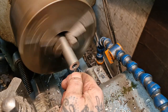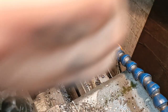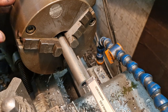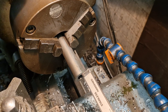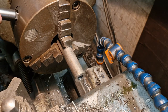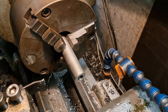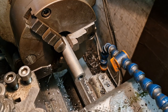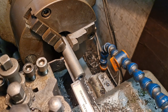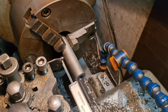With that done, we slowed it down a bit. We'll break that edge and then we'll move the material out. So we've got at least 45mm plus the 3mm for the tool. I've got my vernier gauge set at the depth I want, and I'll just come half inch off the face of the chuck there, so I know that I can get in with the parting off tool. I'll get this nice and tight, and then find my parting off tool. Drop it in the tool holder, tighten things up. Using my depth gauge on my vernier, we'll just bring that into there until it touches the face. And we know that's where we want to be — so that should be golden.